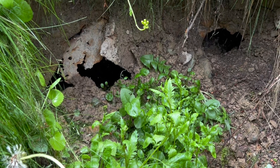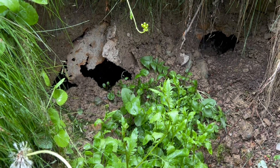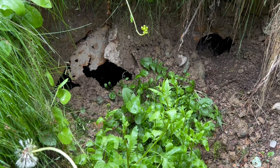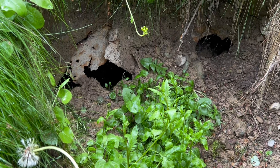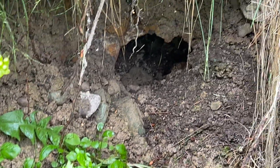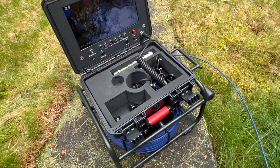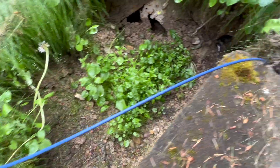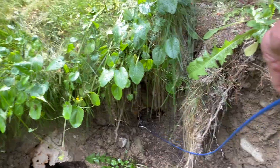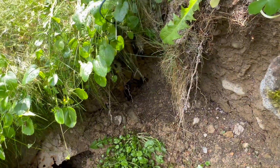So there is another element to these things. What I'm worried about here is I don't know how big this is — it collapsed. I've got overhanging old cement. I don't know how much more it's going to collapse. I want to see how big these caverns are under here, and also what the composition of the material is, because I'm going to have to either dig them out or hand fill them with something and then fill the hole. I'm trying to avoid breaking any old cement because then I've got a cement project as well — for the sidewalk.